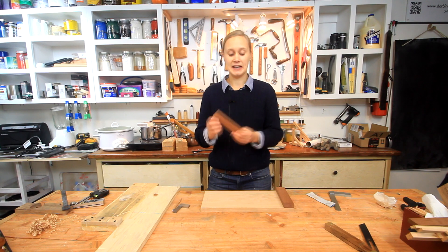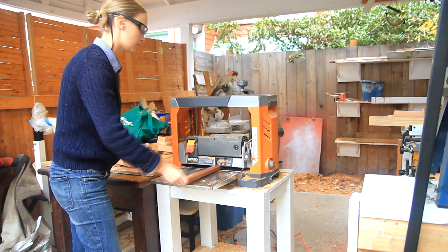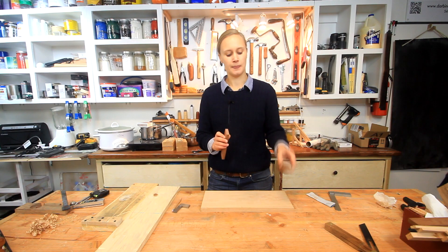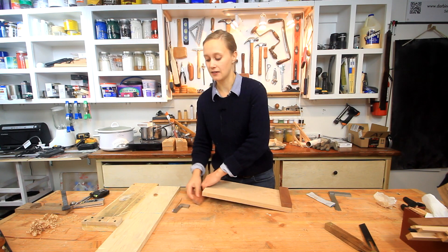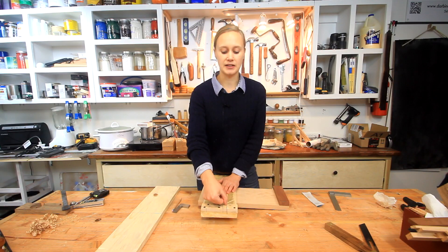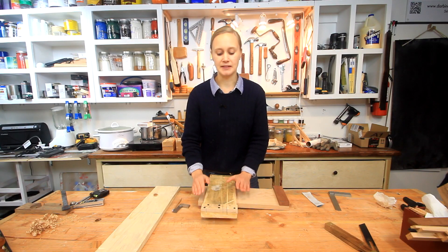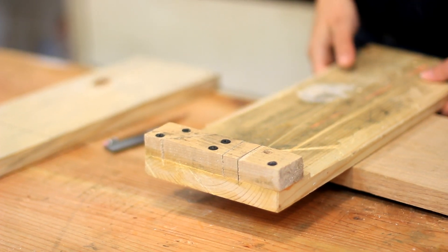Another thing I did was plane down the mahogany for the hooks - two pieces. I planed one down to make sure it was about a half an inch in thickness, whereas the other is three quarters of an inch. That's because I want one side of the hook to be a little higher than the other. On my old hook I made a couple of angle cuts - a 90, a 45, and an 85 degree - so you can make as many angles as you need, and it becomes a miter box.